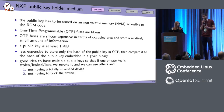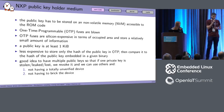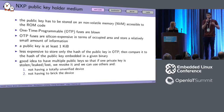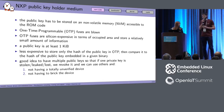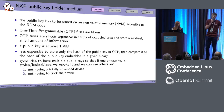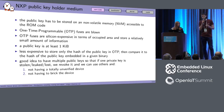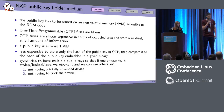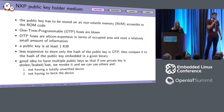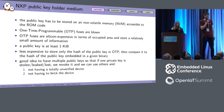So basically, a fuse, e-fuse also, we could illustrate it with a wire. And when the current passes through the wire, then it's a binary one. And you apply a very, very high current to it, and it disrupts the wire. And then you get a binary zero. That's how it works. And it's irreversible. So once you have blown a fuse, well, it never gets wired again.